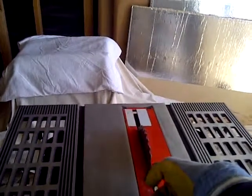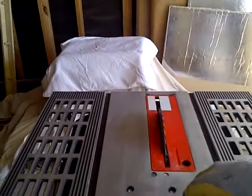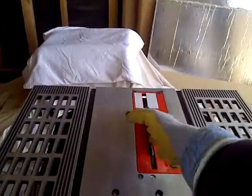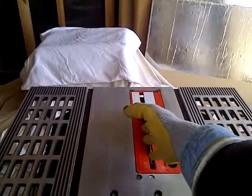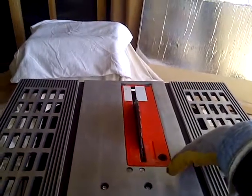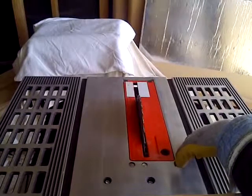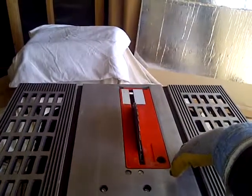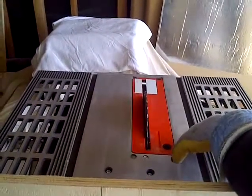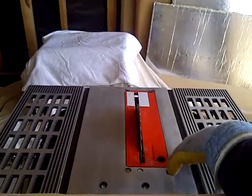Maybe sometimes, but the important thing was, again, I hate to repeat myself, but my previous videos on the setup of this was, it's important that the blade is parallel to the guides. If they're not, it's just a big waste of time, especially if you're making a sled for your table. It's happened to me, and you can see all the trouble I went through. If you guys are into trying to fix things that don't work, you'll spend the time trying to fix it.